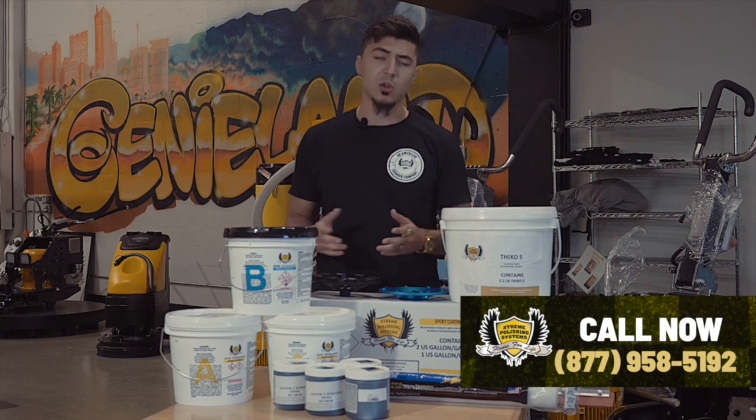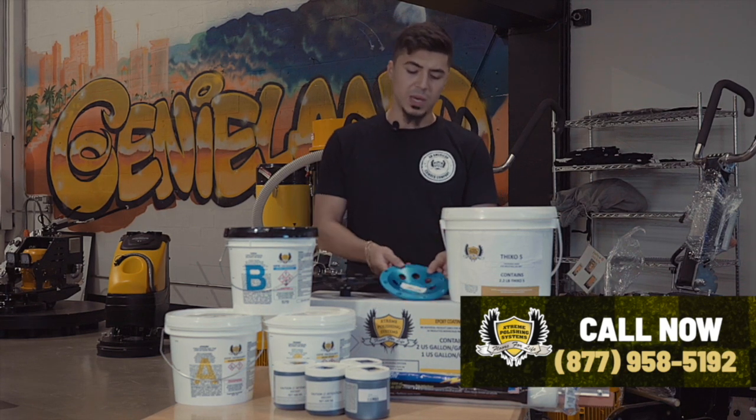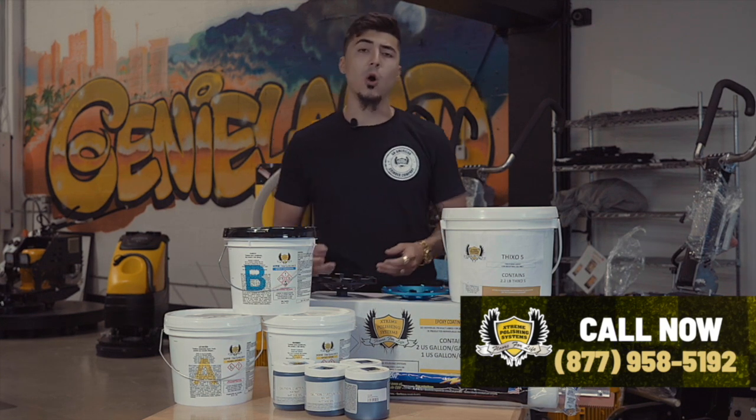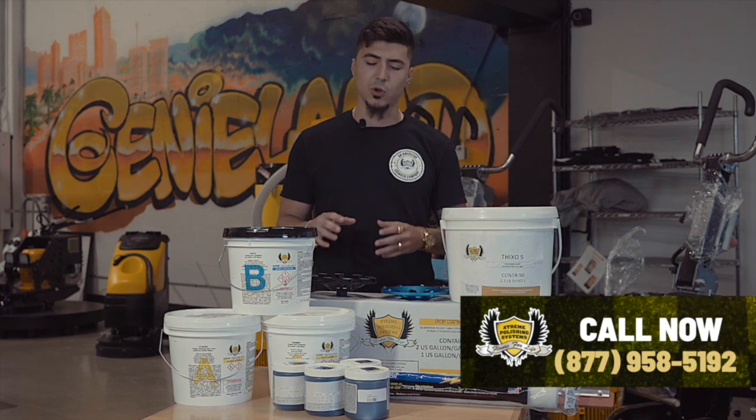If it's not too big, you can use a hand grinder with the PCD cup wheel and then with the 30 grit metal. Or if you don't have any glue or epoxy on the floor, you just use the 30 grit metal.